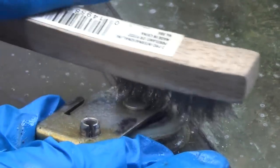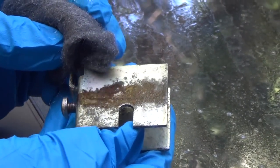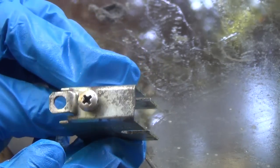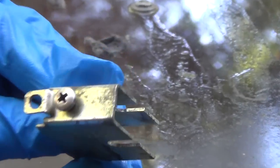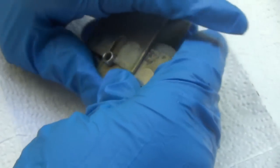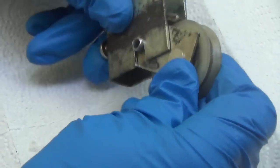Let me try to get some of this crud off with a nice stiff brush. Now that I've removed most of the scale, I'll take some fine steel wool and just try to clean it further. Now let me clean the inside of the wheel. So it's all cleaned up. Notice the screw there — that's the adjusting screw, and right above it is where it attaches to the door. I've cleaned both parts of the wheel assembly and now I'm putting the two pieces back together to make certain they're going to move freely. I'm pretty satisfied.